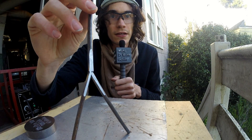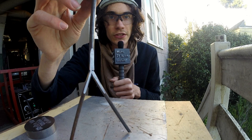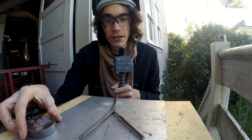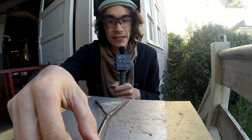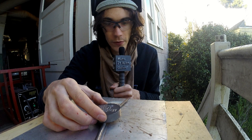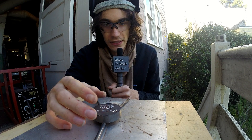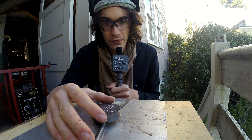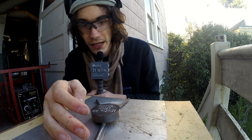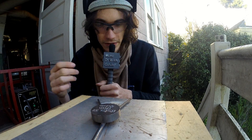One other really helpful tip: grind a flat spot onto your metal. It doesn't need to be much, but you will thank yourself for it. Now that I've got it lined up, I'm going to line my weight up as best as I can. It doesn't need to be anything perfect, but I want this to look nice, and I'll come along and tack it and then lay a little bit of weld on the other side.